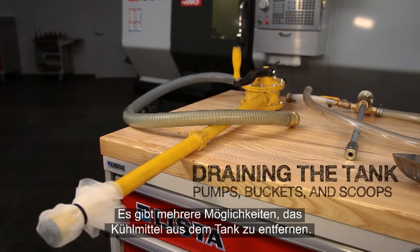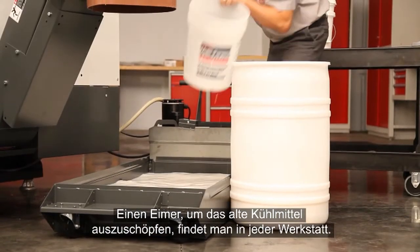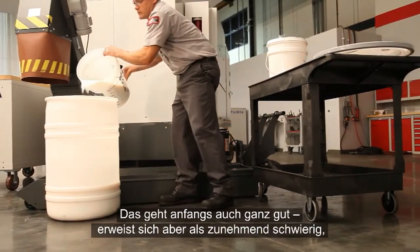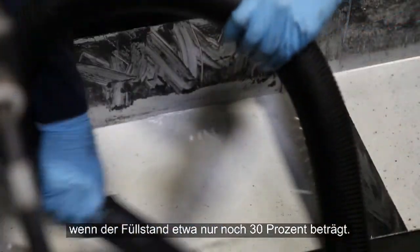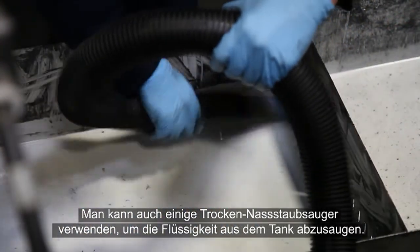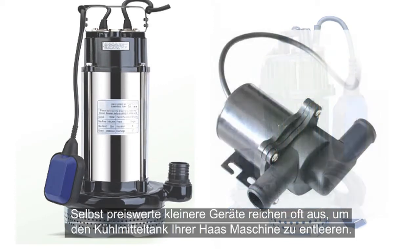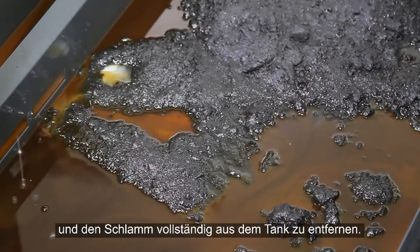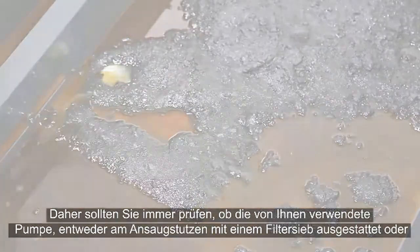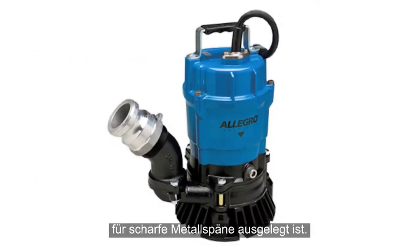When you need to drain the coolant in your tank, there are a number of ways to do this. The most readily available method is to use a bucket to bail the old solution out. This starts off easy, but it's difficult to get all the coolant out once the level is down below about 30% full. Some wet and dry vacs can be used to pump water out of a coolant tank. Also, a wide variety of sump pumps exist. Even inexpensive smaller units can often be used to drain the tank of your Haas machine. But it's usually difficult to remove all the chip particles and sludge from the coolant before it's pumped out. So make sure the pump you're using either has a filter screen at the inlet, or that the pump is rated to handle sharp metal fragments.